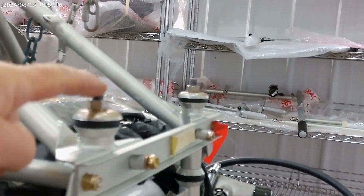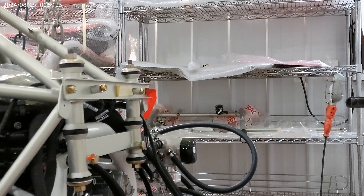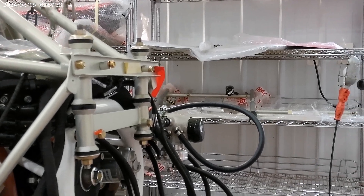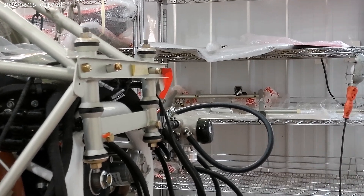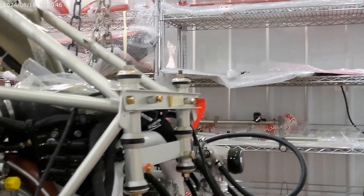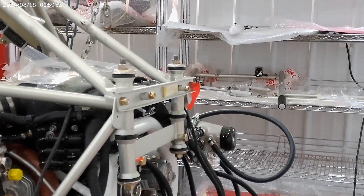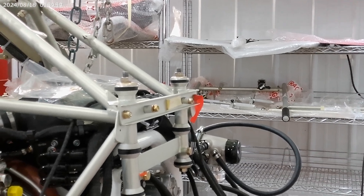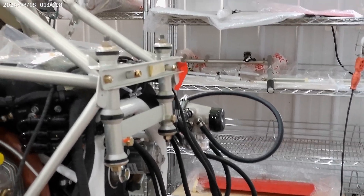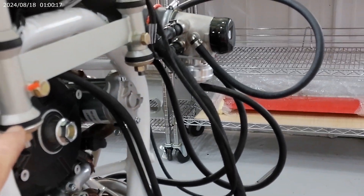There's a stainless steel bolt here, and of course one on the other side — they have to slide down through there. What I found out is when the stainless steel rods were produced there were some burrs on the threads, so I used a tap and die set that had the right size, used the die and started over the edge of the thread and it cleaned it right up. One of our other members from Sakari USA said all you have to do is take a wire brush on a grinding wheel and it'll clean up that thread — probably because it's stainless steel.